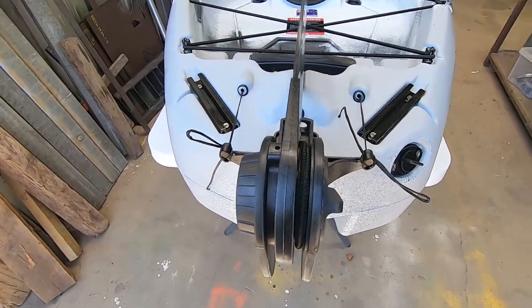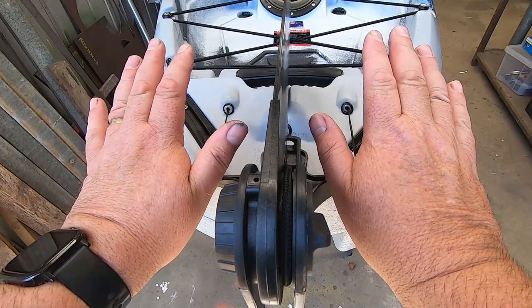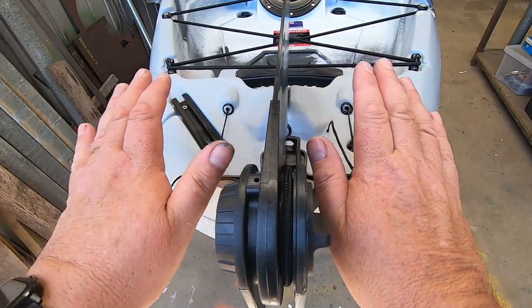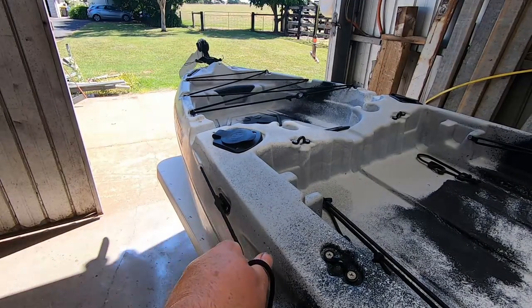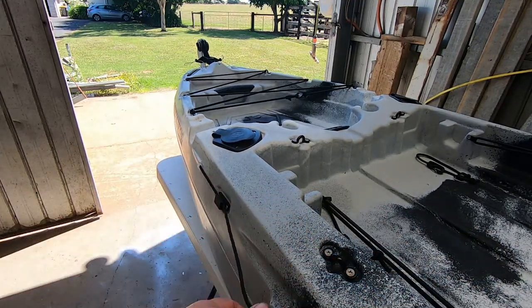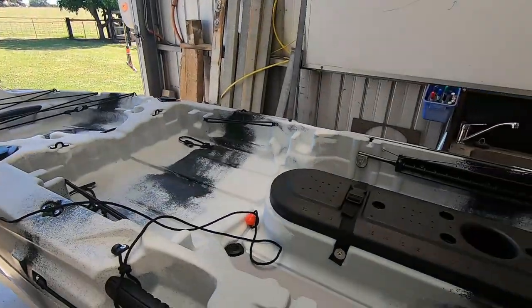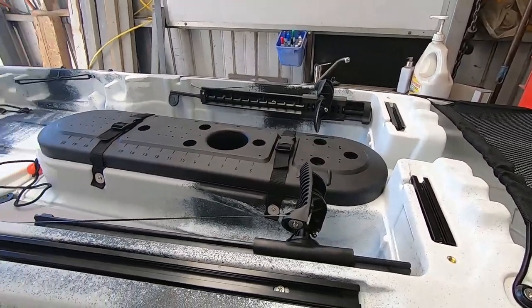If we find that we're cruising along and your feet are straight and it's going to the left or right, all we're going to need to do is tweak one of these cords a little bit to trim it up, basically, and get it nice and level. So all we do is pull your rudder down and into the water, lock it off here on the little quick cleat, chuck that inside, and she's there. Happy days. Come back to here. Got our pedals all nice and lined up again.